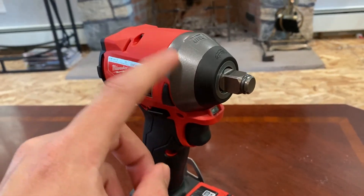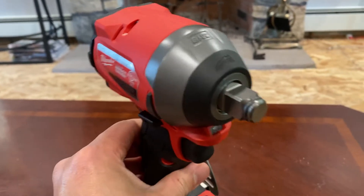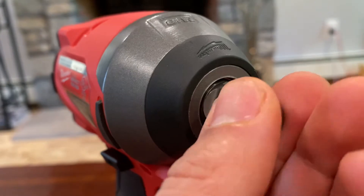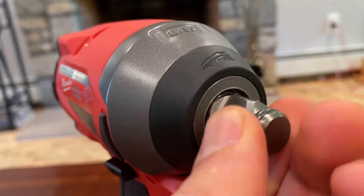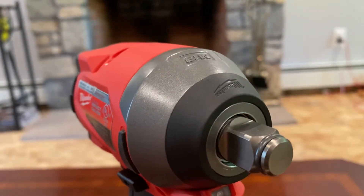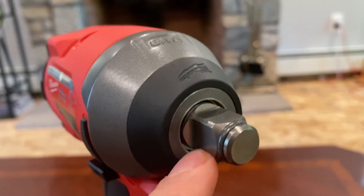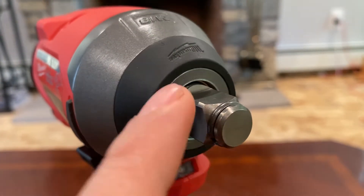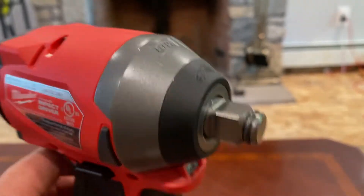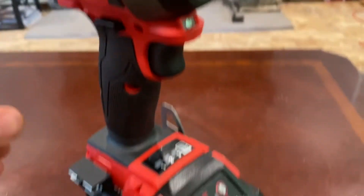The way this was completed was to split the shells, remove the gear case, remove the quarter-inch collet, and hollow out the hole where the anvil fits into. I hollowed the hole out to about 665 thousandths of an inch. Since the anvil measures about 660 thou in diameter, that leaves about a 5 thou gap, which allows for tolerance stack-ups.